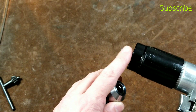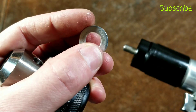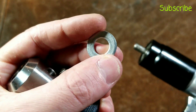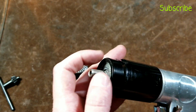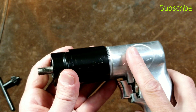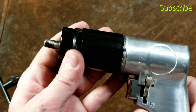Even though the chuck itself and the spindle is straight, using something like just the cheapest of washers is one issue with this air drill and how it doesn't run true. You do have two bearings, so when it is together the spindle is tight. I will admit that it uses ball bearings on the motor and two large ball bearings on the spindle — and that's about all it has going for it.